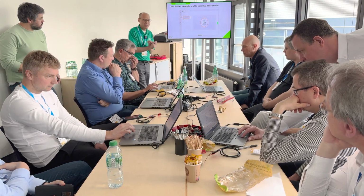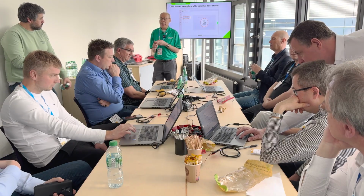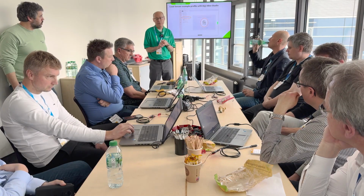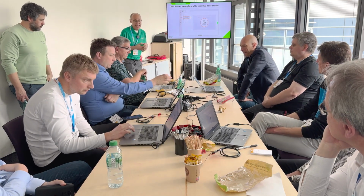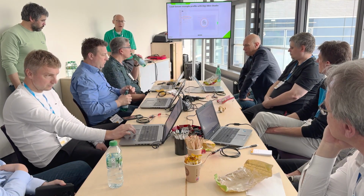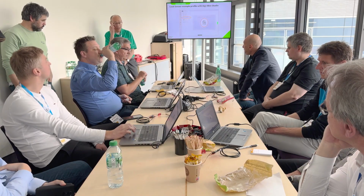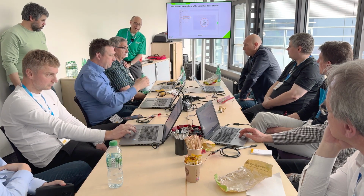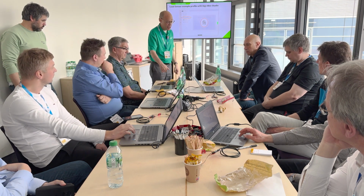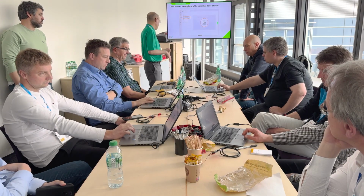It's going to work on your XBee for a little while. What it's going to do is set all the settings, configure the file system, and then load all the files needed into the file system. You could also require a specific version of firmware to be on the device, either current, older, newer, whatever. That's an optional part of the profiles. So it'll go through, configure, and you'll eventually get a green check mark. That means you're done. It may go to 100% a couple times before that. That's normal. What you've done is load the sensor data files and the configuration that's going to allow you to automatically connect to Digi Remote Manager and upload data streams. All of that stuff will get done there.